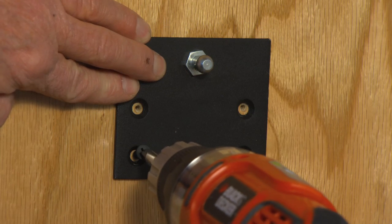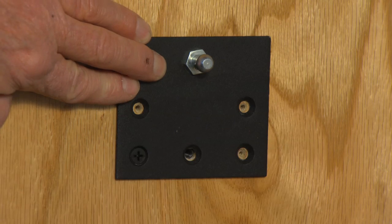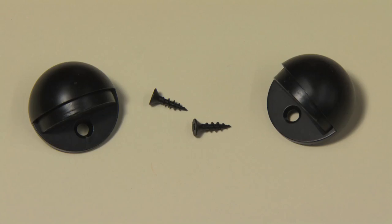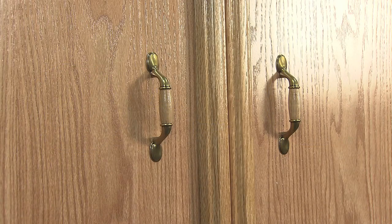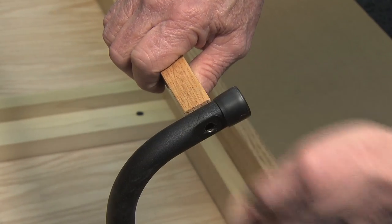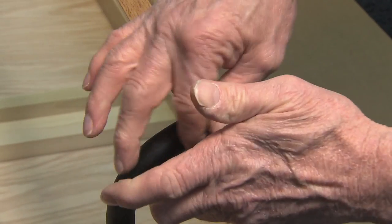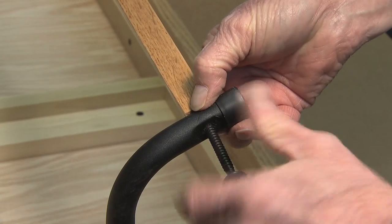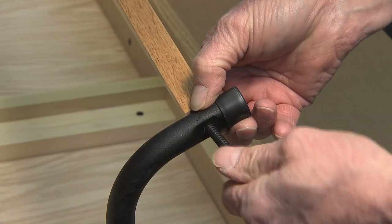After you have sanded and finished all the components of your Murphy bed, reinstall all the Murphy bed hardware except the two domed bed stops. Reattach the decorative handles or pulls on the bed face panel. Attach the leg support rail part I between the metal tubular legs using a number 4 Allen wrench and the two 1/4 inch by 2 1/2 inch leg support rail screws.